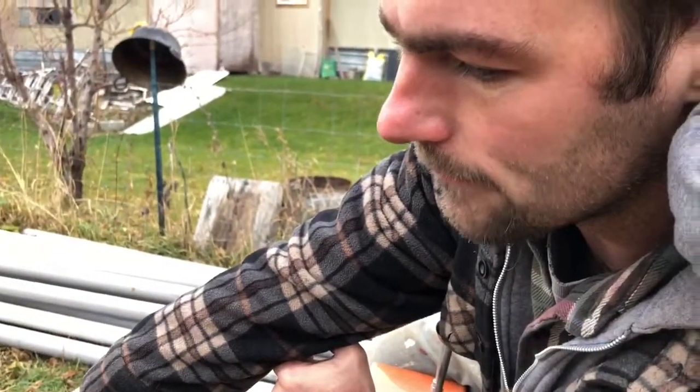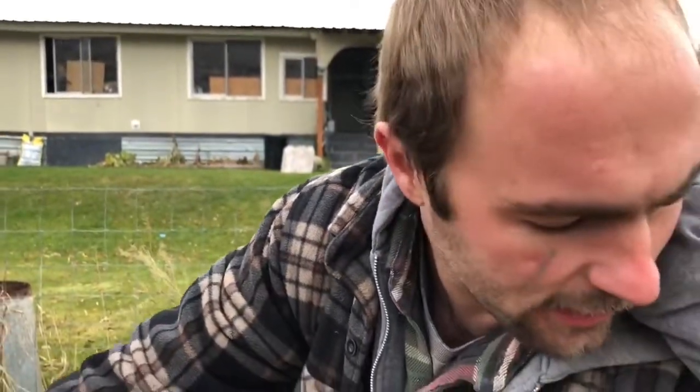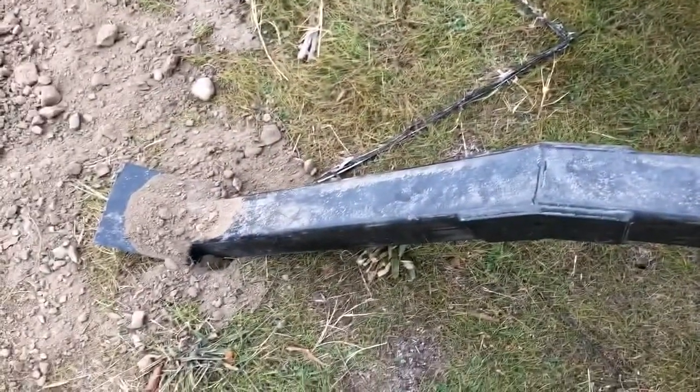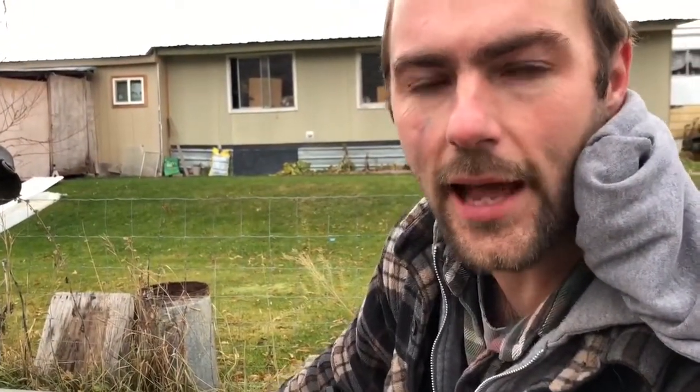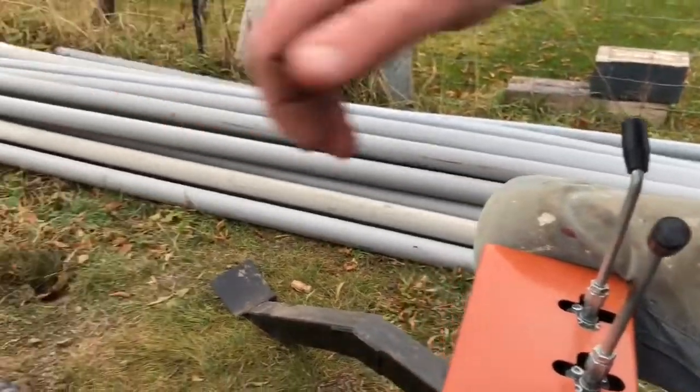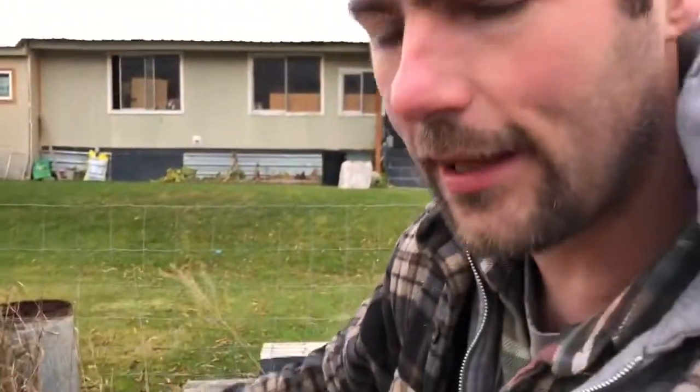Right, there's a great big rock right there, and when I get underneath of it, it has plenty of power to pull the rock out, but the limiting factor is the weight of the machine. So when I get under the rock, lot of power. It's just this lightweight machine, so that's the limiting factor on what you can do with it, basically. And you'll see me bumping this down when I'm dragging my teeth through the rocks, and that's basically to keep the feet on the ground, because if I just drag across, it'll lift up the front end of this. I have to keep bumping this down.